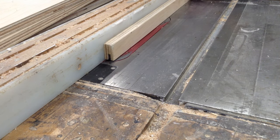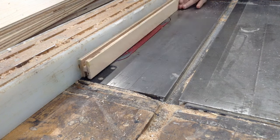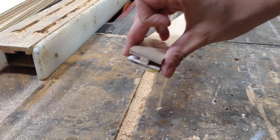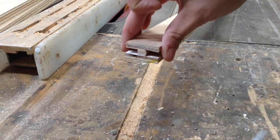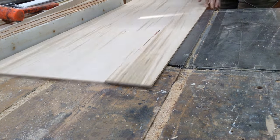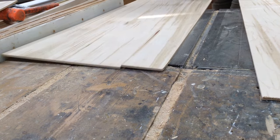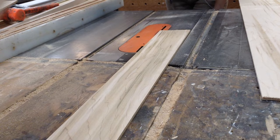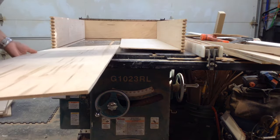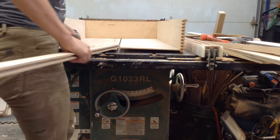I'm using scrap on this — I did not buy any lumber for this. I didn't have enough quarter-inch plywood in the shop, so I had to make a little divider which is essentially an extension for the back panel. That's just a three-quarter inch piece of ply about two inches wide. I cut two grooves in it so the thin ply could be made in two sections so you didn't have to go buy more. This quarter-inch cabinet grade ply is quite expensive these days.